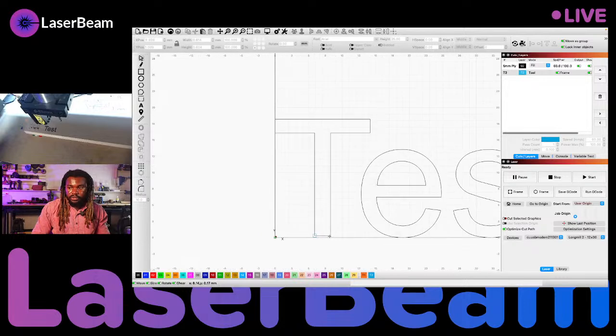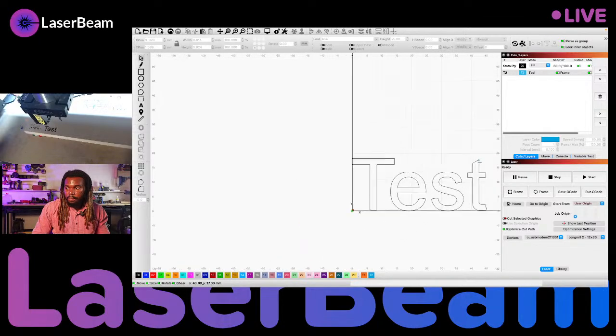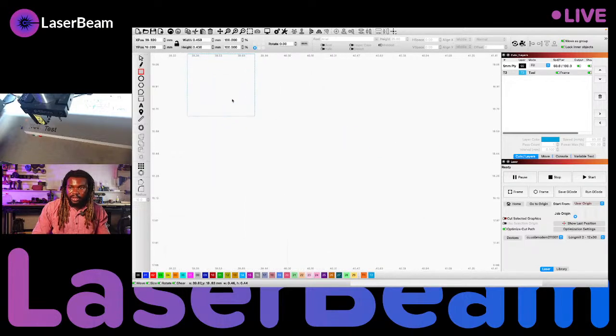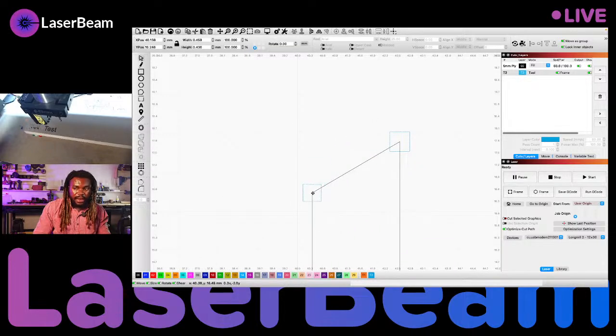And in order for the cut and print tool to work properly, you want to do opposite corners. So there's one down here, and then my other one is up here. Same thing, 0.5 millimeter squared box, and then I dragged it to snap into the corner. If you guys don't know how to drag to snap, just grab your cursor tool, select, and then once this multi-arrow tool appears, you drag there. So now, because I dragged it from the center, this center dot and this multi-arrow tool, it's gonna snap to the center.